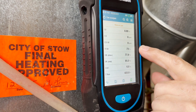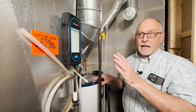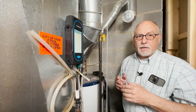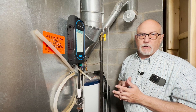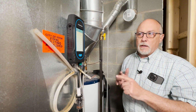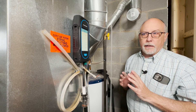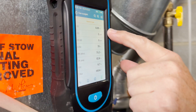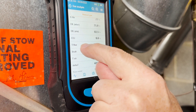Let's talk about why we'd have no CO. A hot water tank can actually burn extremely well. The Sauermann analyzers have an additional feature called a NOx filter. NOx is a cross-interferent for CO — older Bacharach analyzers weren't equipped with it, but more modern analyzers from Bacharach, Testo, and Sauermann all have a NOx filter that removes that cross-interferent so you get a true CO reading. Reading zero CO air-free here is completely normal. Our O2 is now stabilizing around 9%, CO is zero, CO air-free is zero. Let's double-check our draft — still at negative 0.052. Good. Stack temperature flue is 514°F, which is okay.